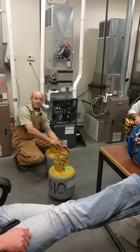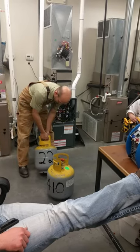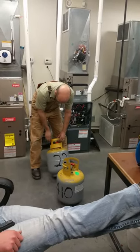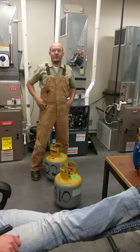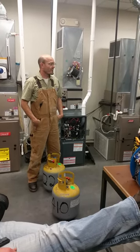So what are we doing with the tare weight — are we adding it in with the water capacity? The 47.7 tells us the full capacity of this tank. The tare weight is when this tank is empty — 28.2, that's 28 pounds 2 ounces. So we could put this on a scale: if we had 28.4, we know we still have 2 ounces of refrigerant or oil left in this tank.